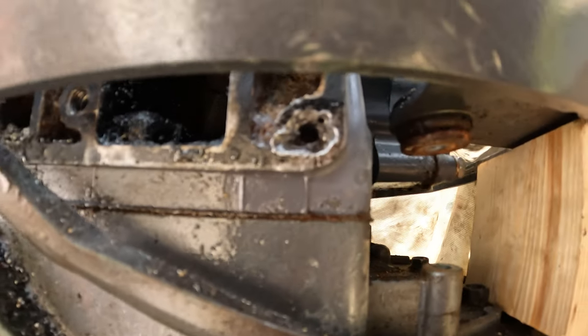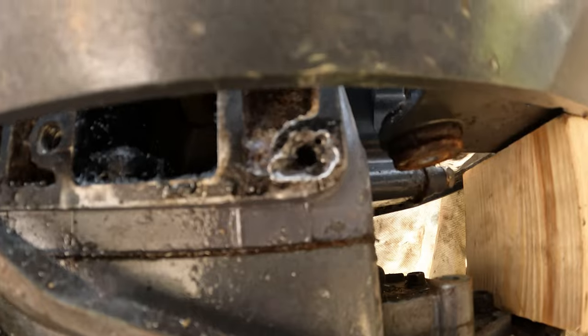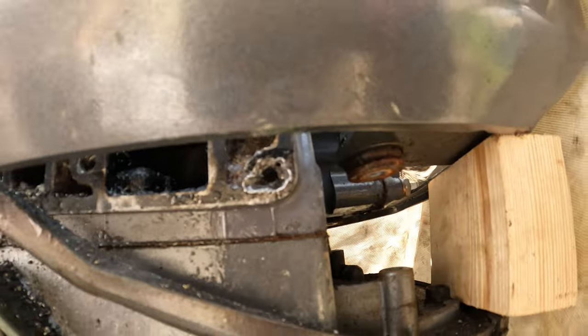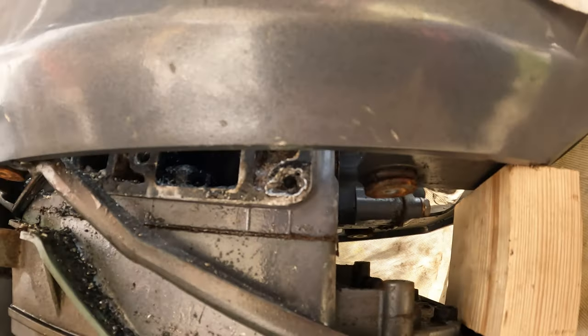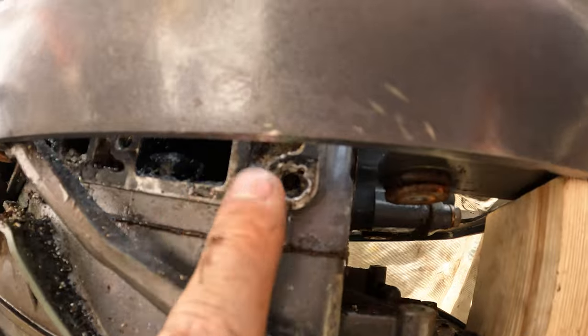There's the damage. There's actually quite a bit left on there. I'm going to just go ahead and drill that and I should be able to get a good tap in there to be able to put a bolt in there. We're not going to extract anything. I need to smooth that off and fill it with some JB Weld. I'll probably even fill this little cavity right here with JB Weld and then smooth that off.